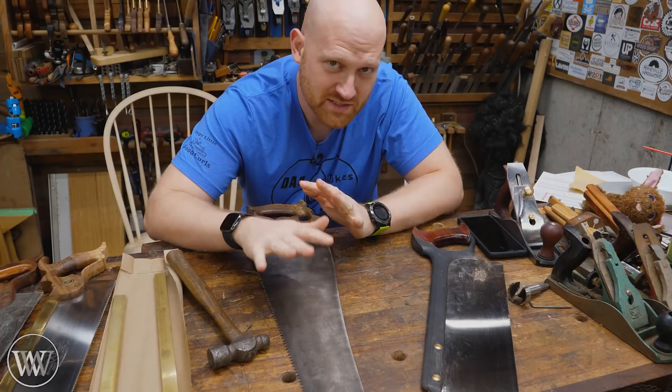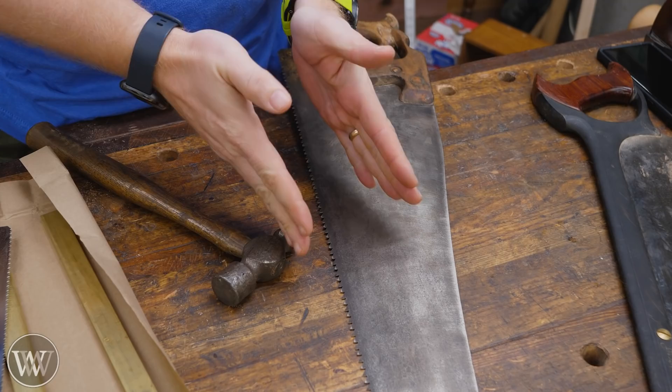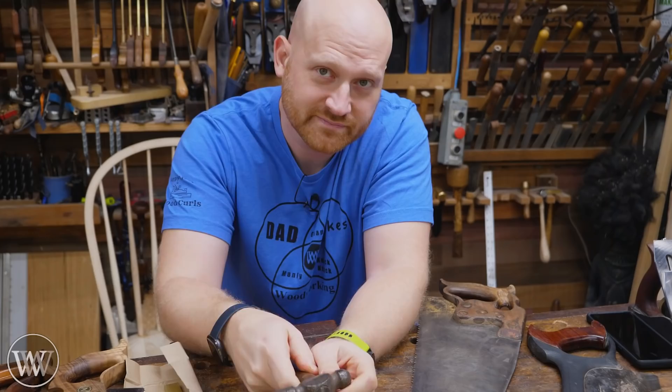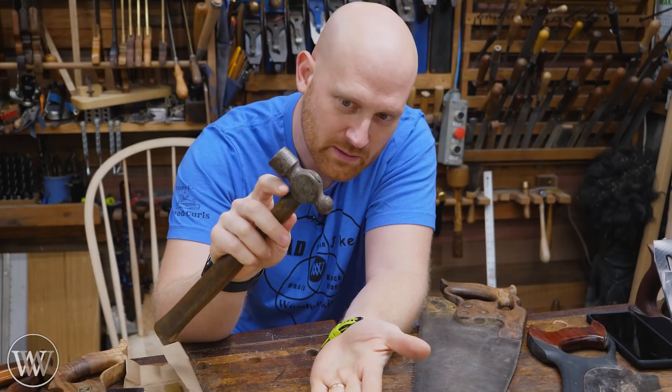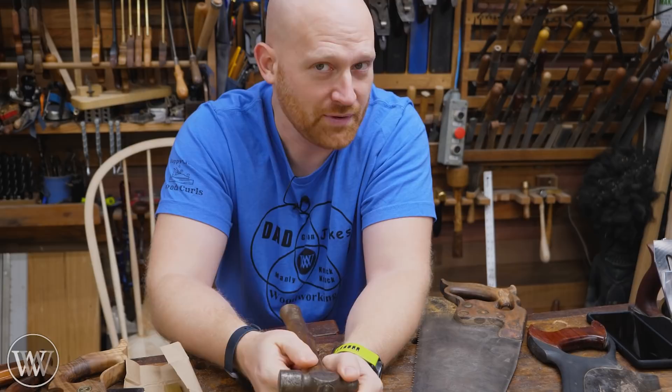Even someone with a good bit of experience still has a chance of not being able to fix a kink out of a saw plate. To fix it, you're going to need a ball peen hammer. What this ball peen shape does is when it hits the metal, it actually spreads it on one side. So if it was kinked, I'd have the kink pointing up and come in here and just tap it on the metal. It works best if you have an anvil rather than wood, but if you don't have an anvil you can do it on wood — just be a little careful and use less pressure. It's not about hitting the plate hard; it's about working it slowly with a bunch of taps, constantly going at it.